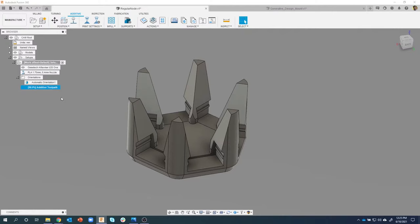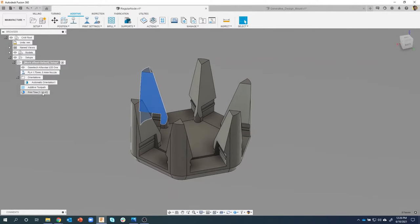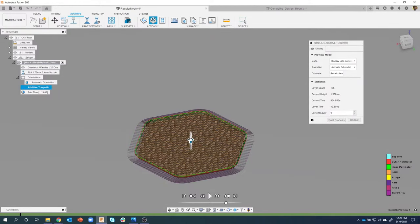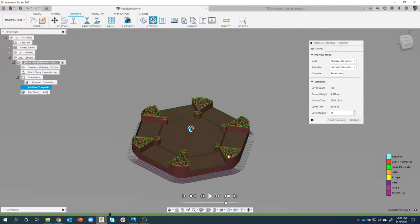It'll go ahead and calculate - you can probably hear my machine cranking away in the background. I see a lot of questions coming through - since I'm going solo, if anybody watching knows the answers please feel free to help with those. The toolpath is done - it says 119 layers. Let's simulate and we should see a finer gyroid infill. Sure enough we do - you can see a much tighter infill including in the arms.